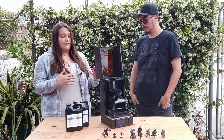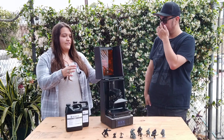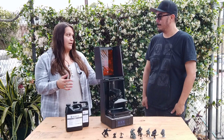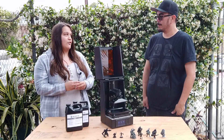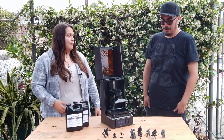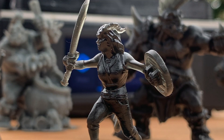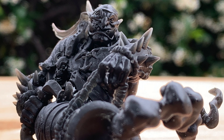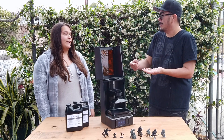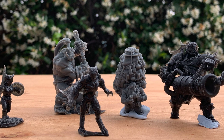So can you tell me some of the key differences between FDM printing and resin printing? There are a lot of people out there — specifically people printing miniatures for tabletop gaming — who think they can get the same results using an Ender 3 with a specific mini profile. Yes, it is possible to print something that small on an Ender 3, but realistically, let's look at time of production. It might take somebody a couple of hours to print a single model on their FDM machine, and there are so many variables involved. On a resin printer, I can line nine of these up on a single build plate and an hour and a half later, I'm a happy camper.